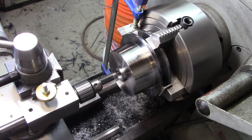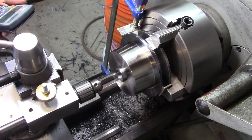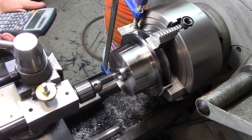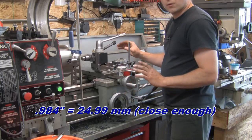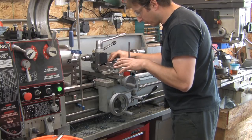now a 50 millimeter bolt pattern gives us 1 inch 969 for a diameter, because again, I'm using inch tooling. So that's diameter divided by 2. Gives us 984 thousandths.